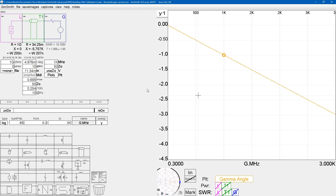If you've built some of those loads I proposed in video number 78 and you have the ability to grind off just a little bit of the open, they will work to a little bit higher frequency a little bit better. I suspect very few people will do this — it's more of an exercise in understanding how important it is at these frequencies to have the reference plane be the same for all the loads. I thought somebody might find this interesting, and I will report on the results for the nano VNA, which is what started this when I got those loads recently. I'll do a video on that. Thank you.